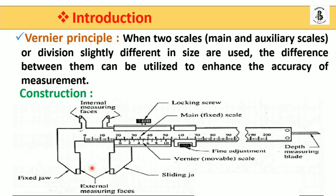There is one more component — the depth measuring blade. By using this depth measuring blade you can also take a reading for measuring height as well as the depth of a cylinder or any kind of job. Once you fix both jaws according to your job, there is a locking screw available for locking the final position of both jaws. There is also a fine adjustment screw so you can take very accurate readings.